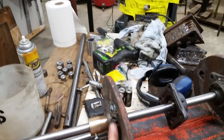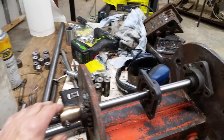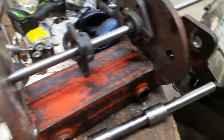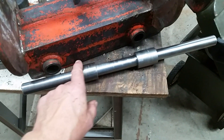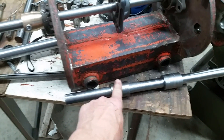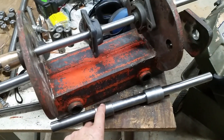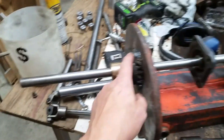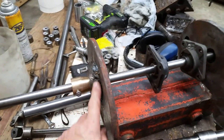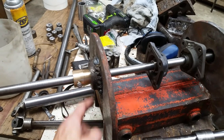I turned two bosses on the lathe, and to get them centered, I took a one-inch piece of shaft — because at the time that was the best straight shaft I had — turned some adapters to get up to an inch-and-a-half, and stuck these adapters into the inch-and-a-half hole on both ends, put the shaft through, then put the bosses on each end and welded them. The reason I did it this way is because I knew the heat would warp the bushings, probably really badly.